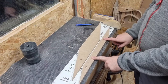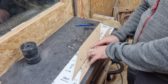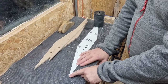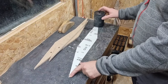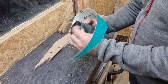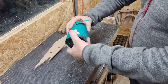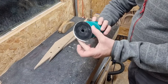I also have the template for the 1-inch drum, which means less waste. It's a good idea now to get your rubber sanding drum and do a test wrap of the paper so we know which way to wrap it when we move to the next step. We start with the point and run the short side around the top of the drum, and the sandpaper will coil around the drum. As we go around we can see that this orientation is correct because it starts to roll around the drum, and there you get a full covering on the drum. So there's our test fit.